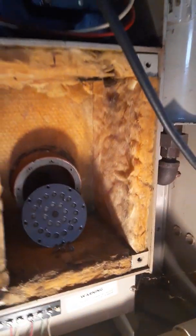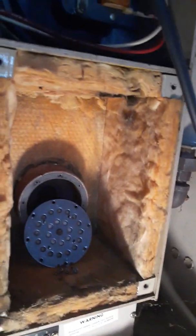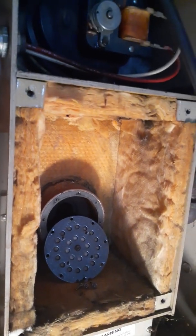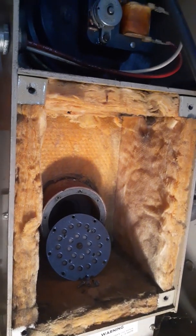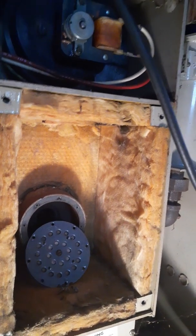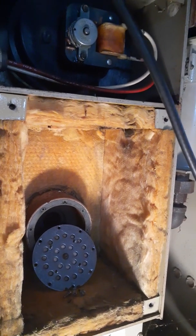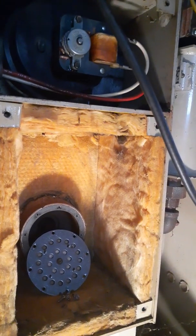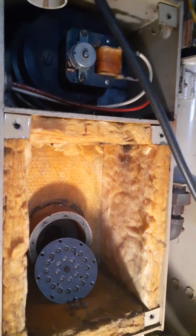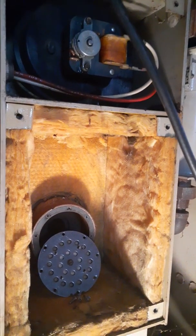When the flapper is dirty but everything else is working, you'll hear it trying to kick on — the fan will kick on and you'll hear it give a hum. It's a classic issue in these Lennox cedar furnaces: the flappers get dirty.